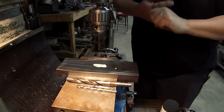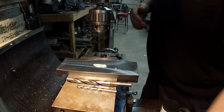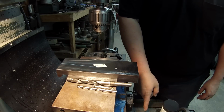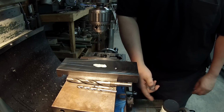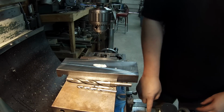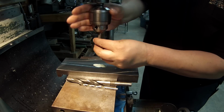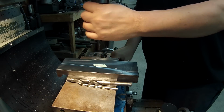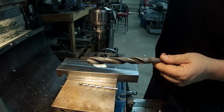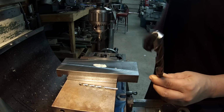All right, we're going to go ahead and drill our hole, and we're going to use our Stan Z approved anchor lube for a lubricant. And I've got a dab down here, you might be able to see. I didn't do that on purpose. I didn't put the lid on. When I set it down, it fell over, so I'm going to use up this little bit here. I'm going to drill a little pilot hole with a 5/16, and then we're going to drill a 41/64 hole for clearance for a 5/8 bolt. I just put a brand new grind on that using the Lyle.